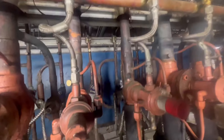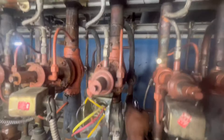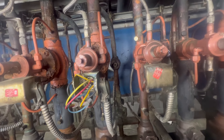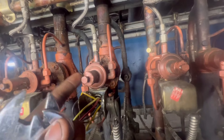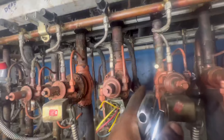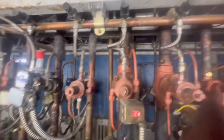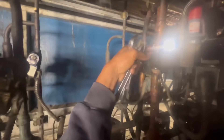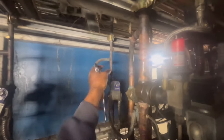This is a good example — all the lines back there are your liquid lines. This is your suction; this will have hot gas, so I got an extra pipe going into it. What it would do is — I think it normally closes this and leaves the discharge line open, so you're gonna have hot gas coming into suction and then it's gonna exit out the liquid side. The suction will always be big and your liquid line will always be pretty small.